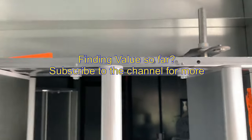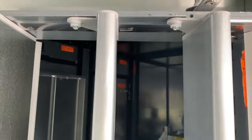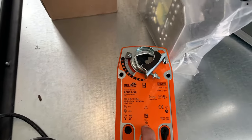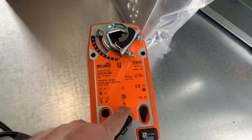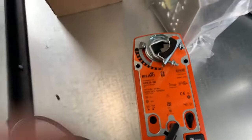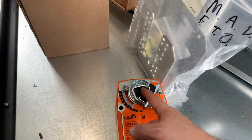The way we have this set up is that when the unit loses power, the actuator has a spring on the inside of it — right here. You have a little hexagonal hand crank which goes into here, and you spin it the direction the arrow says to put tension onto the inside spring.